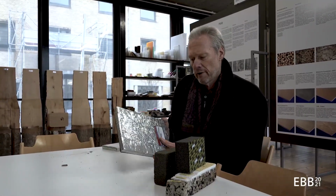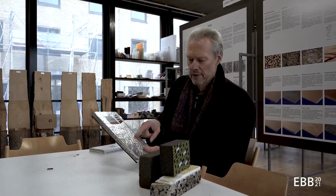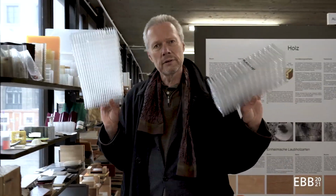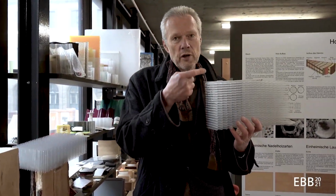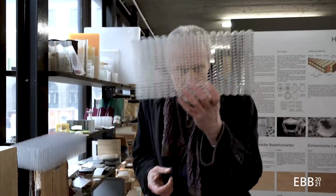And this is something very high-tech, vacuum insulation panel. So there's a vacuum in the inside. The only disadvantage is that the vacuum is rather fragile, and it often starts to leak, and then air gets sucked in and the thing becomes less efficient. So it is very often combined with conventional insulation plates to make it more fail-proof. Here two other high-tech insulation materials for the inside of a glazing. This is transparent insulation that avoids the circulation of air on the inside of a glass panel. So it's transparent, you can see me.